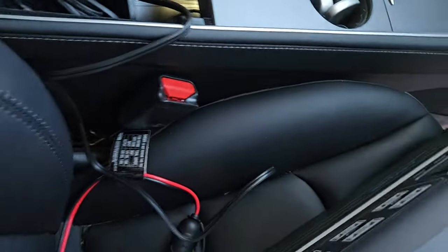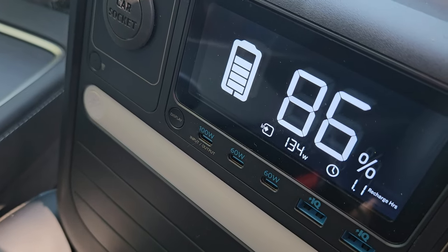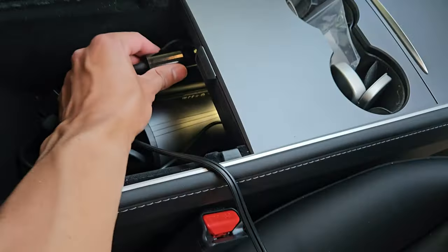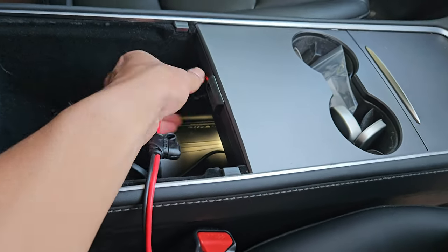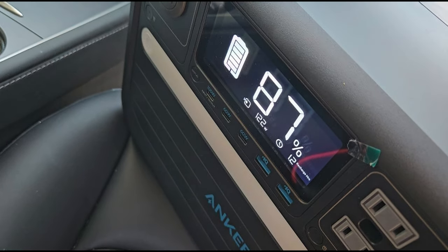To test this, I plugged the original Anker cable in and we're pulling about 135 watts. At around 16 volts, that's in the neighborhood of 8 amps. Now with the extension cable, we only get 122 watts — not 135. The 13-watt difference is due to the wire length of about 17 feet. I ordered a shorter, thicker wire at about 13 feet and gained back 2-3 watts, so I'll use that one — it's also cheaper.